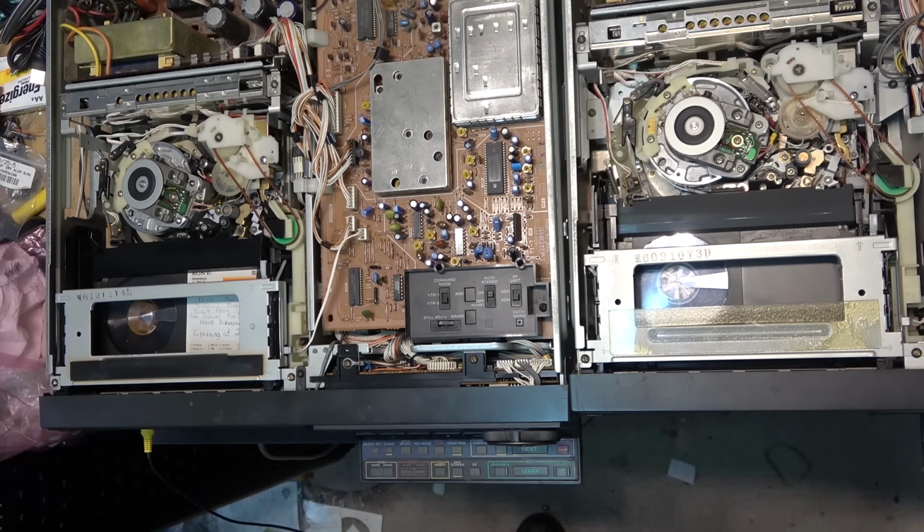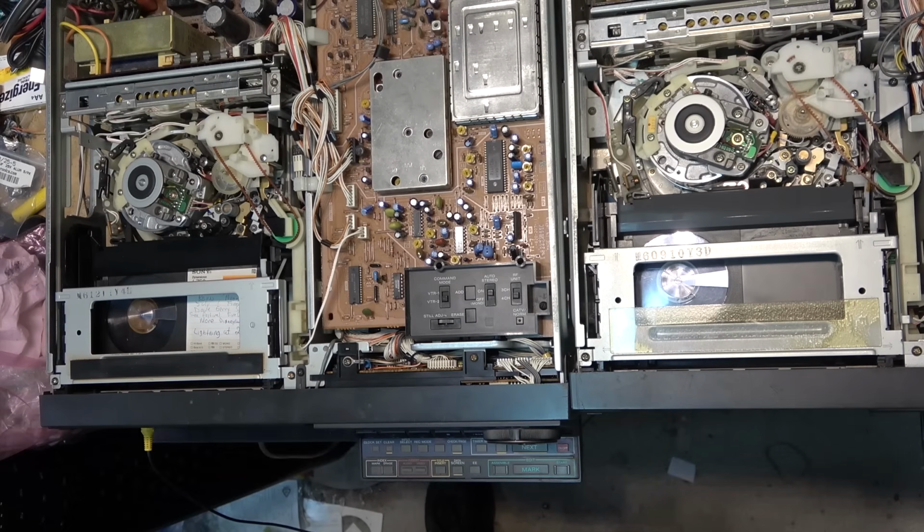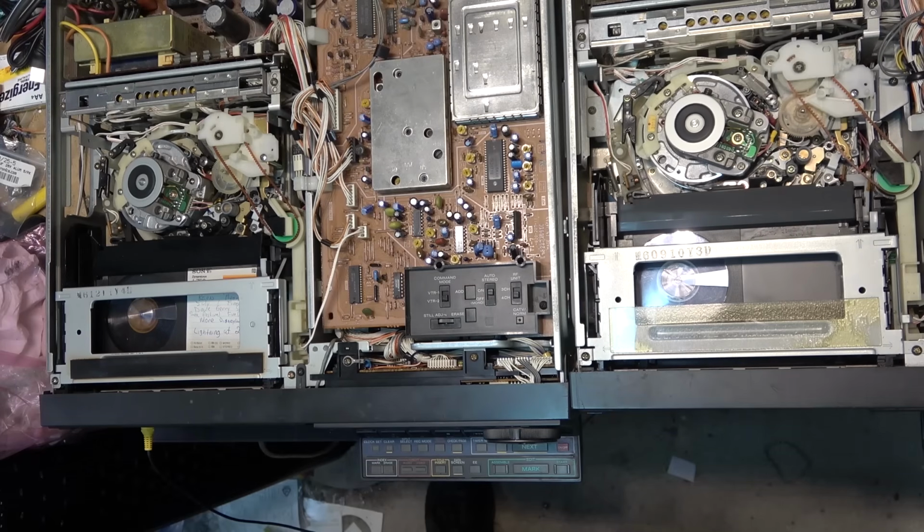They could be anywhere on the tape. These decks both feature a 5-second pre-roll, so at the beginning of every shot you'll see that it will go back an extra 5 seconds. They'll both pause momentarily and then they will roll in sync for that last 5 seconds, and then right at the frame would cut in.